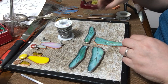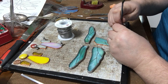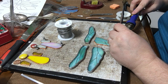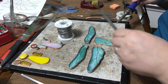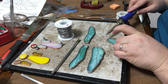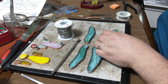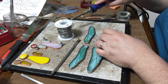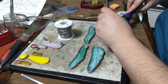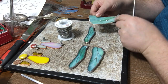I'll add a little more flux up here. I use the gel flux — I used liquid flux for 20-some odd years and just recently changed over to the gel flux, which I do like better. It just doesn't make as much of a mess. So for anybody who was interested, I know there was a forum post this last week where someone was asking how they put on these little veins — that's pretty much how you would do it. Just use your tinned wire of whatever gauge you prefer and go to town.